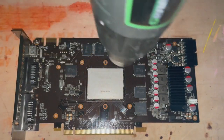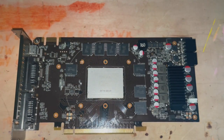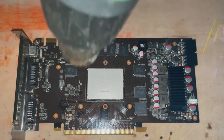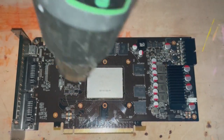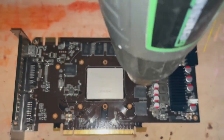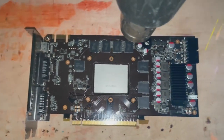So low airflow, 750 degrees Fahrenheit, in a clockwise motion for about seven or eight minutes. You always want to keep that heat moving, because if you let it sit in one spot too long, you get a really hot spot. You can either burn out something else on the board like a memory chip close to the GPU, or burn out the GPU by getting one side way too hot while the other stays cold. You can also stress the GPU in weird ways so it doesn't reflow properly. So keep that heat moving around.